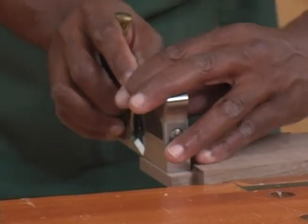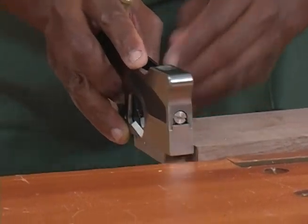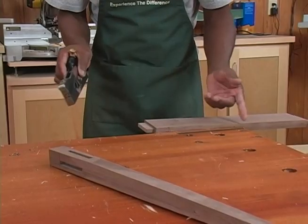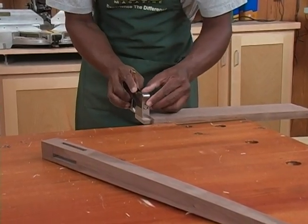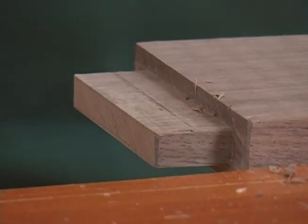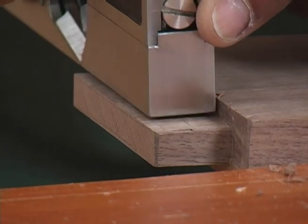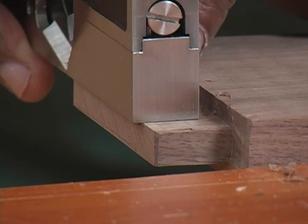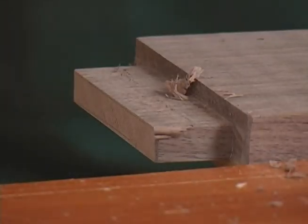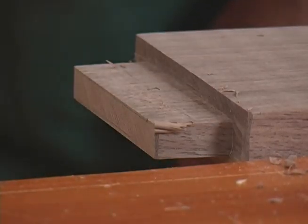I'm going to take a couple of test strokes, adjust my depth of cut until I'm removing the desired amount of material — and that looks about right. The planing is pretty straightforward. The only thing to be mindful of is that in situations where the tenon length is greater than the width of the sole of your tool, you're going to have to take one cut near the shoulder, then move the cut away from the shoulder for the second pass, then back near the shoulder and alternate like that, so that you don't end up with a wedge but rather a tenon that has good flat geometry.